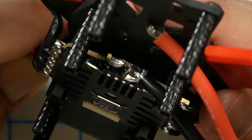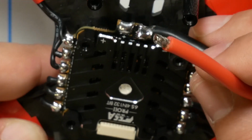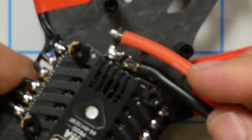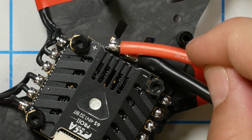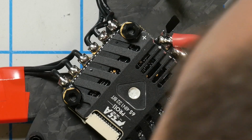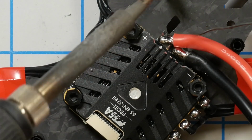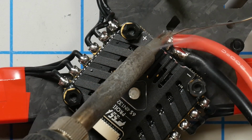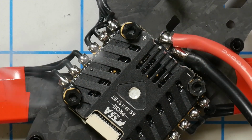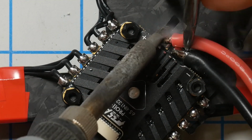It's pretty smooth and liquid and silver. Okay, I feel okay about that. And then this guy's going to come in from the side like that. Yeah, no problem. There's not near enough solder on there, I think. I want to get a lot more solder, so I'm going to lightly apply more solder without applying enough heat to completely flow the joint, and then apply more heat.